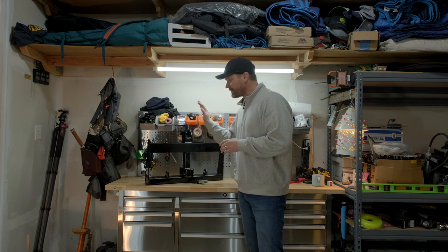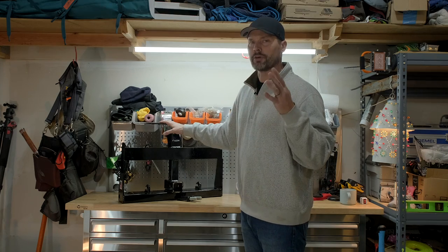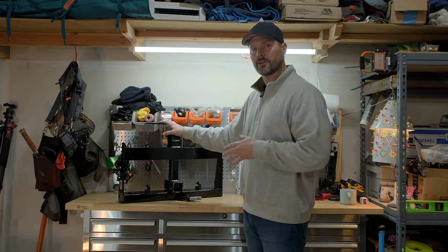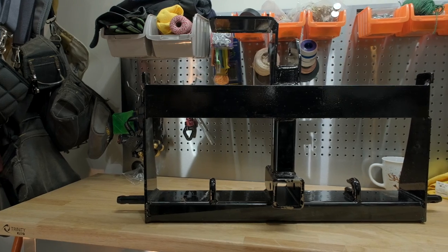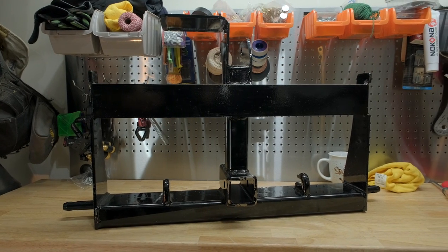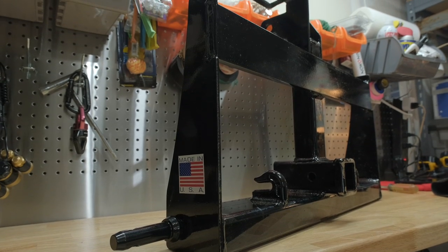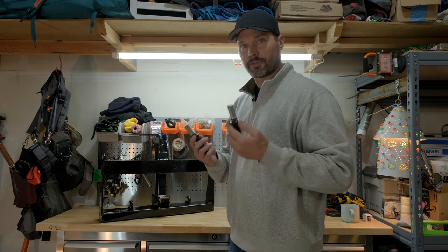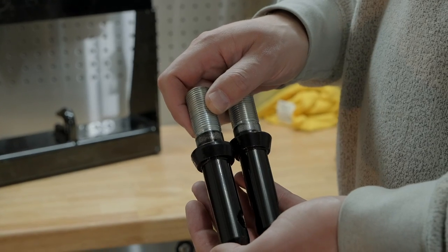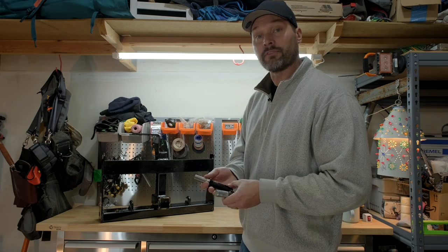A little update here on the Versabracket — we've gone to version 2.0 now. This is the first look at it. What we've done is switched to tube steel down here. We did have angle iron to begin with, but we've now put an entire tube down there just to help with the strength, the rigidity, and just overall product improvement. The next change is that we're switching over to threaded pins, and we did this to get to a more standardized setup versus the welded pins that we previously had.